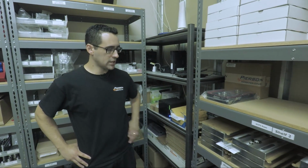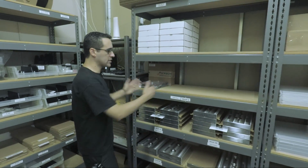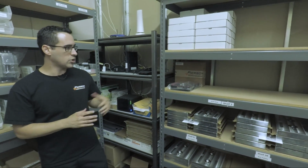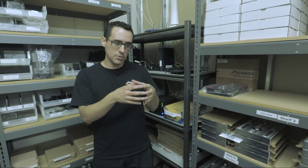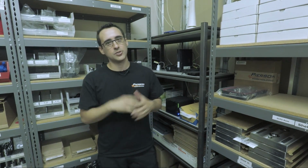So we have customers that use our 10-16 pallets with 3 across. So that's 30 by 16. That's the exact window of envelope of it. So they can just take vices on and off. Customers will have bores of varying diameters. So when their probe does that, they know the location, they know the diameter, they know the offset of that vise. So it's all programmed in.